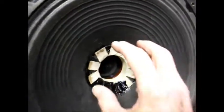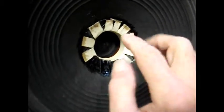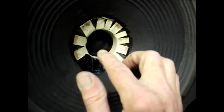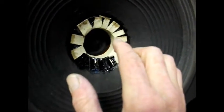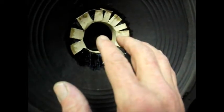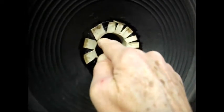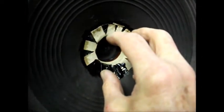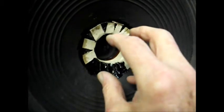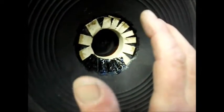I put the centerpiece in and joined the cone to the voice coil. The leads to the voice coil winding were intact so I didn't have to touch those. I used a toilet roll — it fitted exactly — with a super glue gel which is slightly flexible. We'll have to see what the results are.